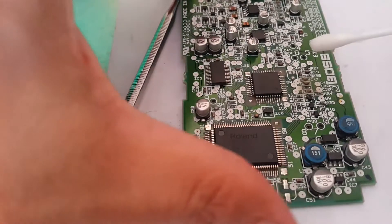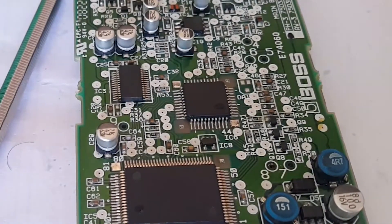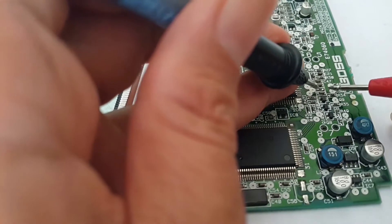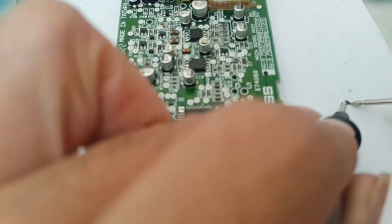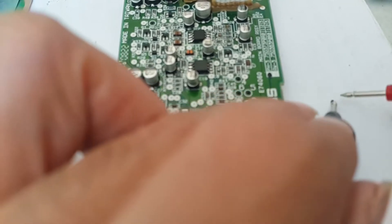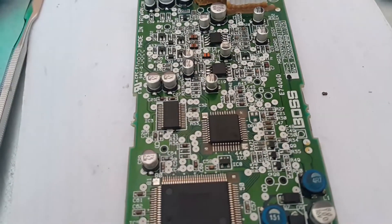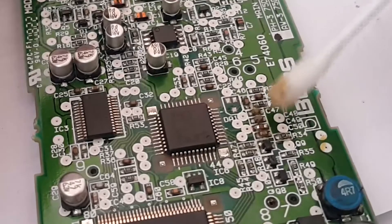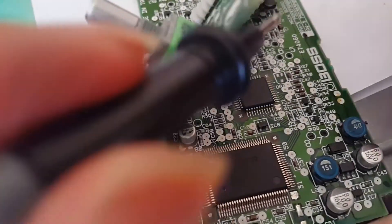From the diagram I believe it's 0.1 microfarad. Let me check again with the multimeter — it's still half-short. I'm not sure where it's coming from; I'll check the diagram. The capacitor is also short — it's still half-short. I already replaced it with a 0.1 microfarad, but I guess it still has a short.